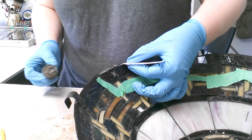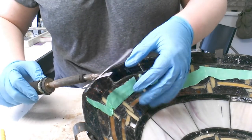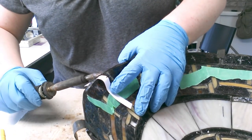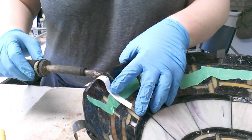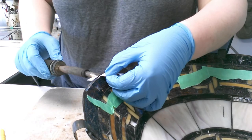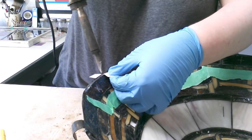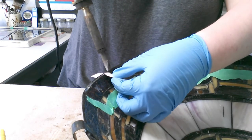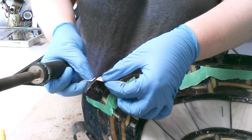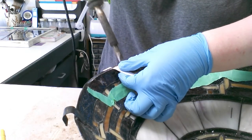You do need to be careful and pay attention to the piece of paper — you will see it smoke every now and then, and it could easily catch fire. However, I've since learned that you can also do the same thing with a piece of a pop can. Using aluminum means the solder won't stick to it and it's more heat resistant, so you won't have the same concerns. You'll see me moving the soldering iron from the bottom over to the top to get enough heat in the area I'm working. By adding that little bit of heat I can liquefy the solder in that section and slip the paper in between — and you can see here I've been able to remove about five inches of solder along the edge.